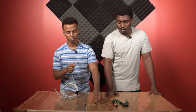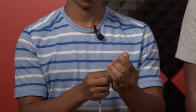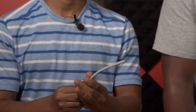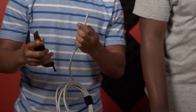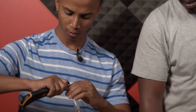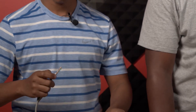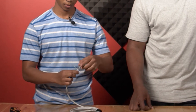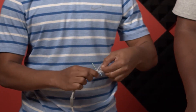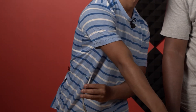First you check the cable, then you place the boot. After that you peel off the outer part. After removing the outer part, we reveal the 8 cables: white orange, orange, white blue, blue, white green, green, white brown, and brown — plus a plastic and a thread-like thing. We are going to remove the plastic and the thread.